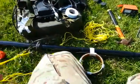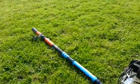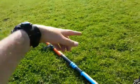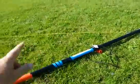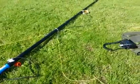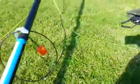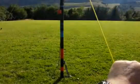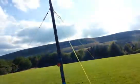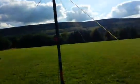What we're going to do is put two guy wires in first — a guy wire there and a guy wire there — lift the pole up, and using the third guy wire to pull it up, peg it in way over there, so you've got your three in. Two guy ropes are in that way, and now it's a simple case of getting the third one in, which will go up over that way. Everything is done at ground level — no need to stand up at all. Going up now — simply holding up the rest of it and getting this last one in, and then we'll check the SWR.